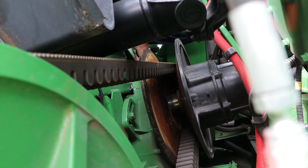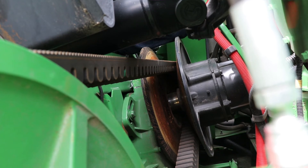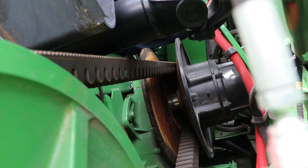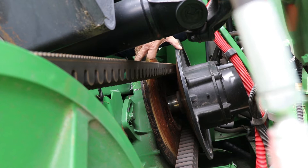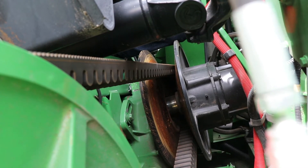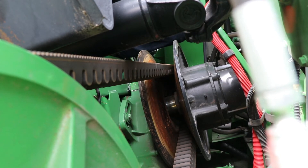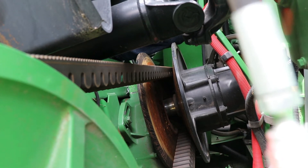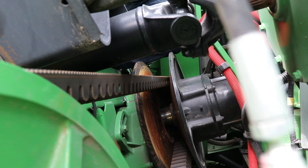There's a big turnbuckle here that you turn to pull it. What you're doing is pulling the belt farther away from the driver with the machine down — in other words, spreading the sheave and adjusting the belt tension. When we put our drill bit in between the sheave and the center, we're measuring how far we're spreading that pulley apart to get the tension correct.